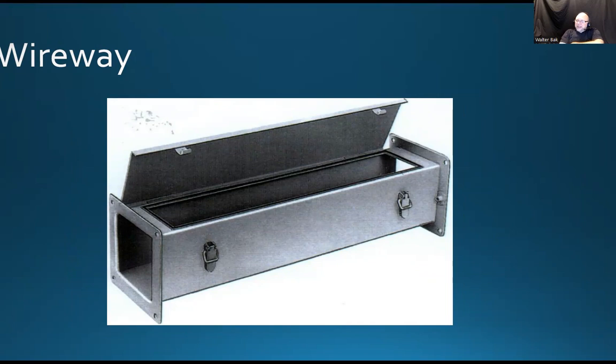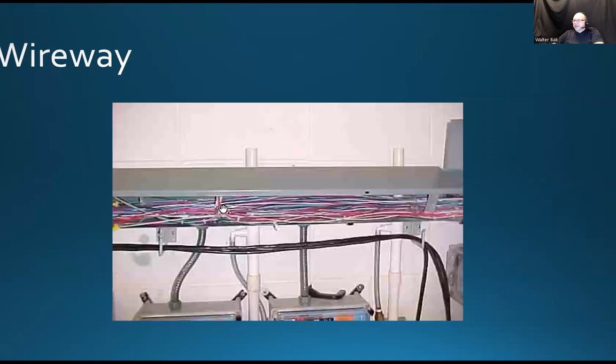The challenge with that is that quite often when people service whatever the system is, you may actually be required to add some wiring from one place to another. So you're just going to run more wire in the tray from one point to another. And people have tendencies to leave or abandon the existing wires even if they are not being used. So after a while, it will look like this. It will look like a filled up system here, and you don't know which wires are used and which wires are not used. So just in case you're not going to damage something that's functional and cut somebody's power off or cut somebody's signal off, you are going to leave it and just keep adding them on.